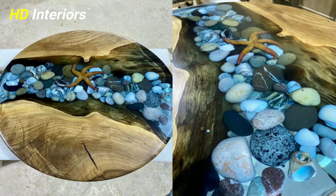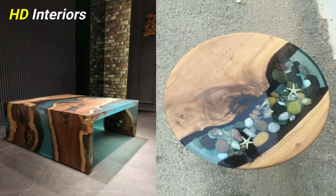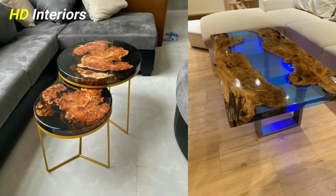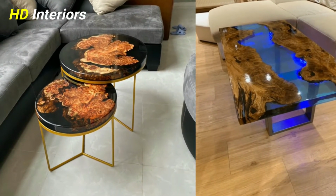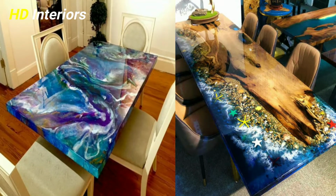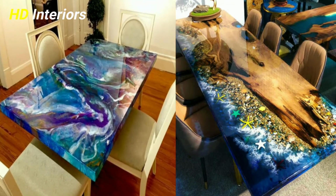Before proceeding, you should make sure that your 2 boards are exactly the same length. Also, the side edges must be cut at right angles to the straight outer sides. Keep in mind that it's also important that both pieces of wood have the same thickness. They should also be absolutely flat. If in doubt, it is advisable to commission a joiner to carry out the finishing work.